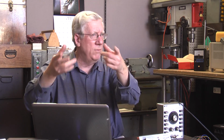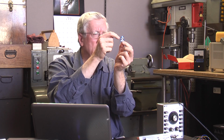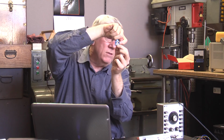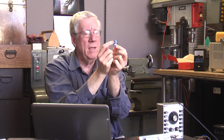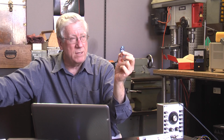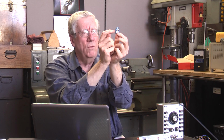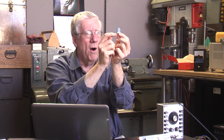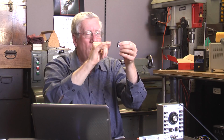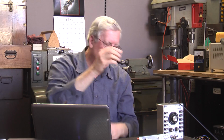All of those slides I went through real fast, where you saw a big picture of this and which pins do what. Well, there are certain pins that take analog or digital data, you can mix and match, but the analog output is two on the other side. Normally, the same pin number that's a switch position corresponds to the same pin number on the other XBee unit that's an LED, but it's really nonsensical. The order is 1, 2, then it's 5, 7, 11, 4. And as if that wasn't hard enough, the XBee goes into a socket where they displace it by one, so you have to know whether it's the pin number of the XBee or the Explorer.